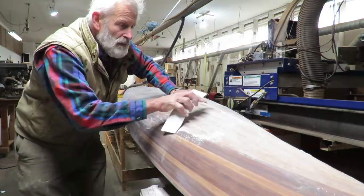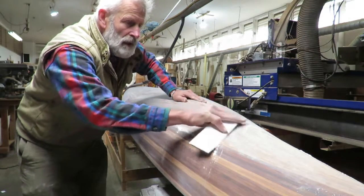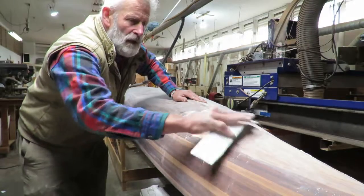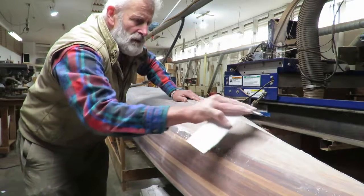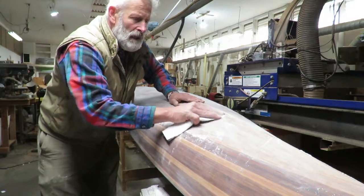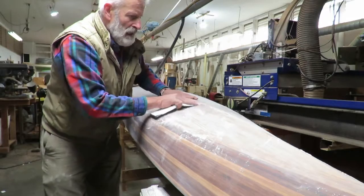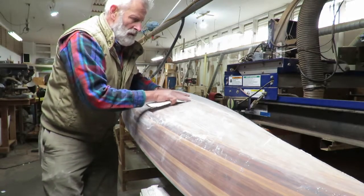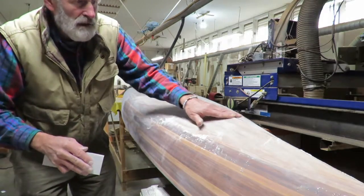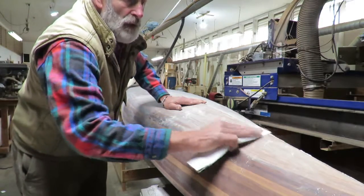You could brush it very lightly with 220 grit sandpaper just like this, but that's about all, very little pressure. That's about all I would do on the crest line. You can sand right up to it on the flat, but not over it. And you obviously won't have any runs or sags on that. It really doesn't need any sanding right along the very crest line except that very light brushing.